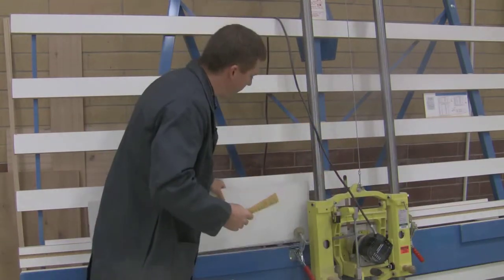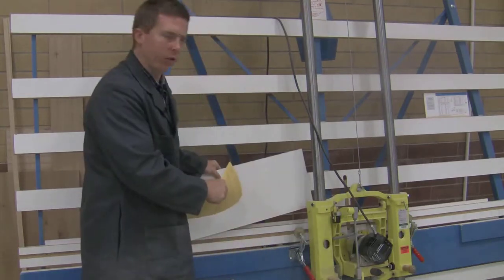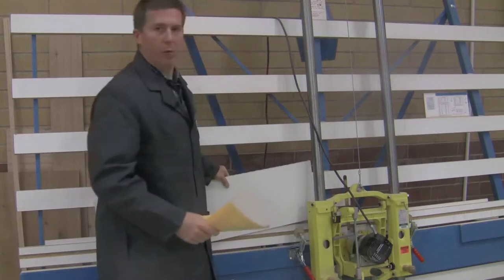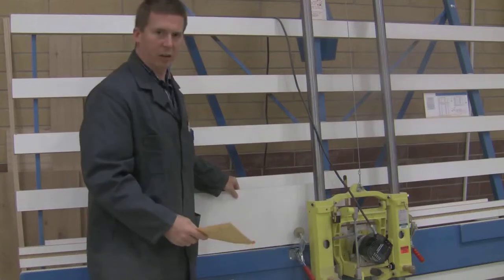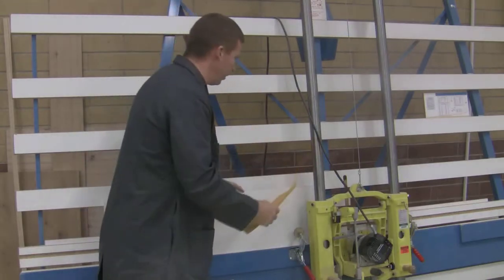When you put this board in, it sits on this ledge right here — it's white. If I have a ton of sawdust under there, like all the other machines, make sure to blow that away really quick. If I have a lot of sawdust there and I put the board on top, then the board comes up off the ledge just a little, and now my cuts are going to be angled. So make sure that's cleared as best you can.